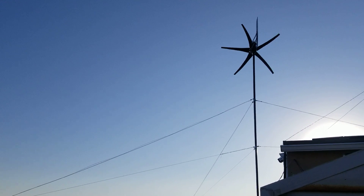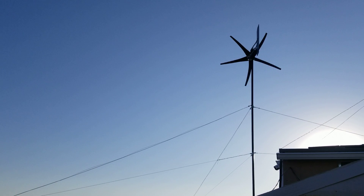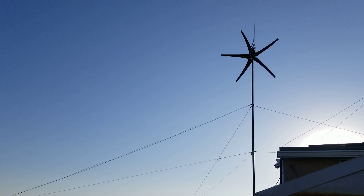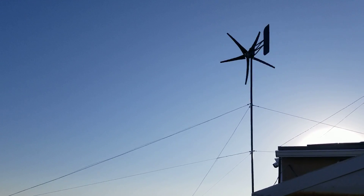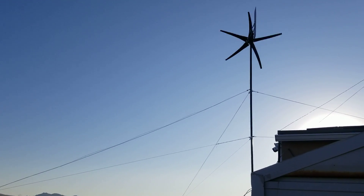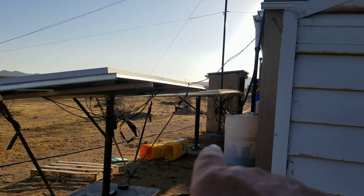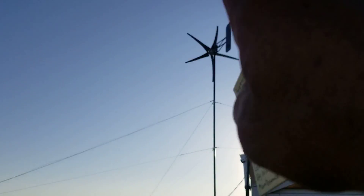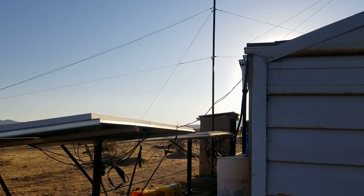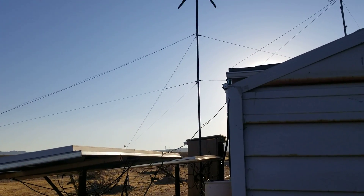I had one other person yesterday mention that they had a PMG two-wire and they wanted to change it over. One of the things on a two-wire is you can save on those because you only actually have to run the positive wire down through the mast and into your battery bank. The negative wire can actually attach to the base of the mast because the mast acts as your ground. So you save a little bit of wire length using a PMG over a PMA, and that's good because you've got to use heavier wire.